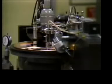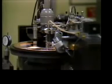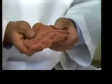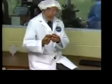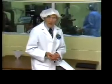The master cutting has now started. This lathe is recording a frequency modulated or FM signal. Its diamond cutter is moving up and down 3 million times every second as it traces out that signal. And this is what's left over. 12 miles of continuous copper filament finer than the finest thread.